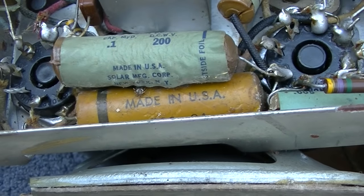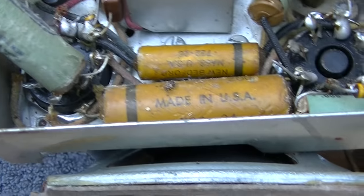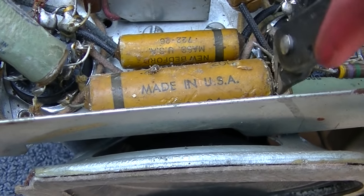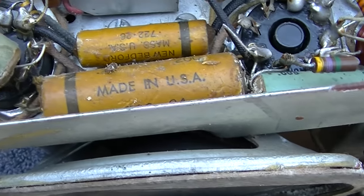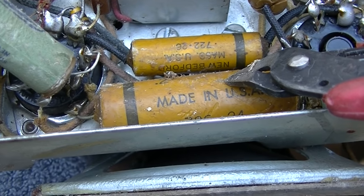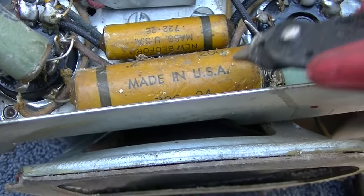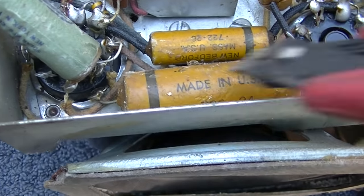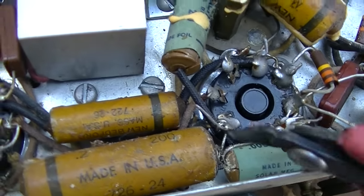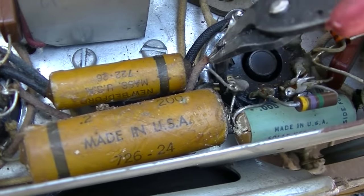The first thing I'll do is just cut it right at the capacitor — leave the old leads in there. I'm going to do the same thing with this one, cut it right at the capacitor. That one I'm going to leave in there — it's paralleled with like a 47k resistor, it's just an RF bypass, I don't care about that one. This one I'm going to do the same thing — cut it here and move it out of the way because these two tie to the same place.